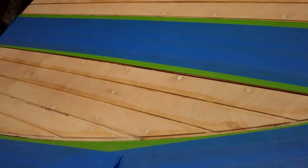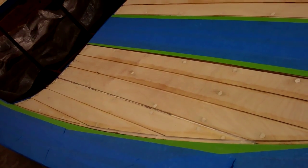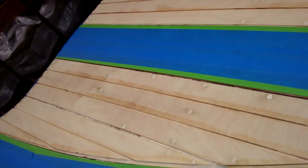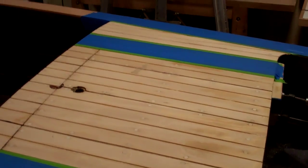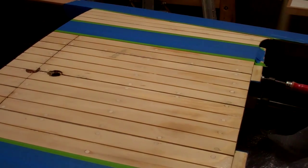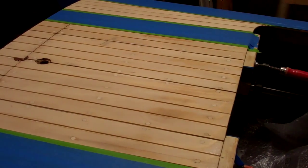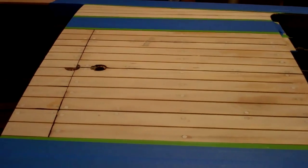And by tomorrow we should have this neutralized and cleaned off, and we'll let it sit over the weekend, add clear penetrating epoxy sealer, and by Monday or Tuesday of next week we should be putting some varnish on this stuff. So in the second installment tomorrow, when we clean this off, we'll be able to share with you the final results of this bleaching exercise. But the Kean-Strip is the best solution to the challenge of bleaching mahogany or Avodire or any other wood that we've come up with so far.